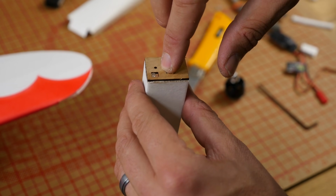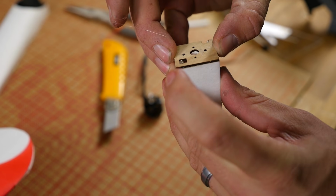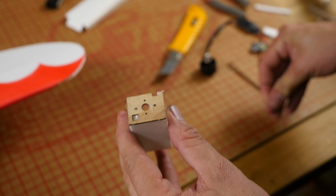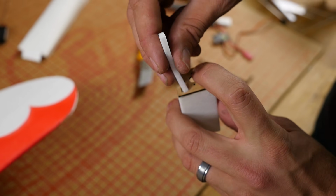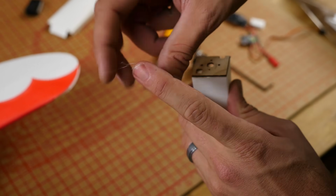Now this will also fly off of the 1806 A-Pack. We're going to be using our new F-Pack, which is the 2204. It's the same as our quad motors for our racers. It's a very powerful, wonderful little motor. You can fly this on both a 2 or 3 cell depending on the experience you want, but the nice thing is you can go all the way up to a 4 cell and really have some crazy speed out of these little planes. Just smearing off that extra glue.